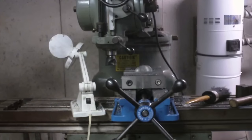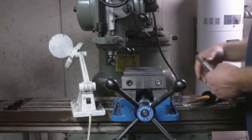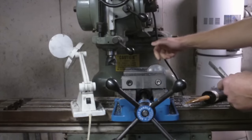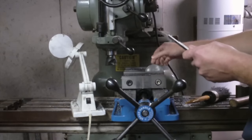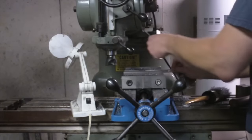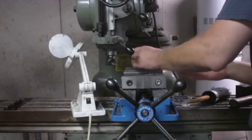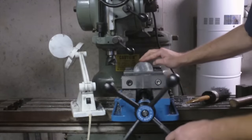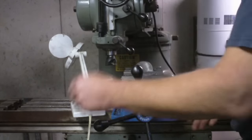Back to the grind. Alright, so I'm going to clamp this in the vise, but I noticed that the vise has a little dip right in the middle here that's not a machine surface. And this hockey puck of mine here is kind of falling into that. So I could put it over here or over here, but then the clamping force of the vise won't be optimal. My understanding is that you want to avoid doing that, so that the jaws are clamping more parallel to each other. So what I'm going to do is I'm going to use a couple of these little spacers. And I'll tell you, it's nice that those magnets are in there. Holds them right in there so they don't fall over on you while you're trying to set them up. Those are the shortest ones I have. So that'll still give me quite a bit of meat down in the vise that's being clamped on, so to speak.